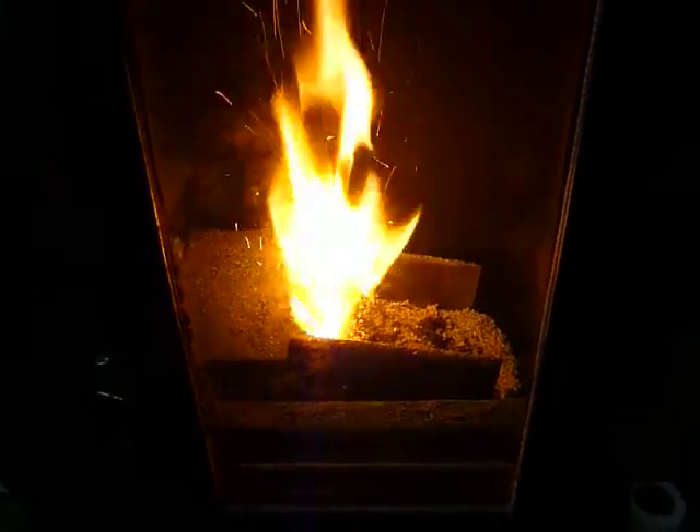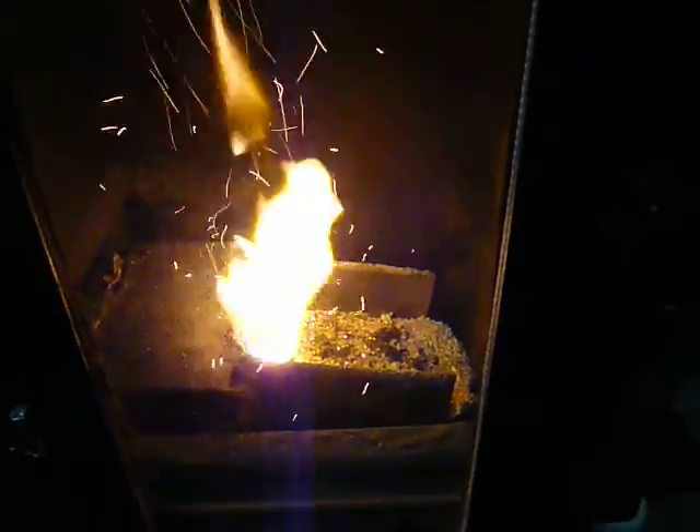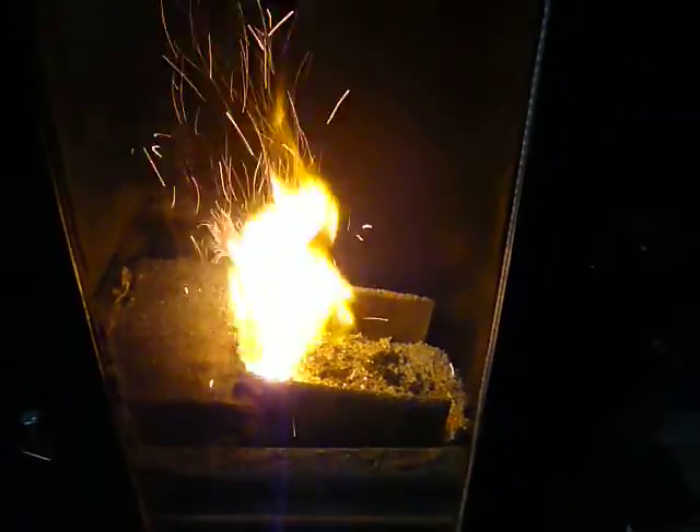It differs from a lot of the ones I've seen on the internet. Instead of just having a flat plate that slides backwards and forwards, there's actually a block mounted on the back of it, so it pushes forward and then pulls back, pushing the coal forward. What I found was happening is that the ash — you can see there it's actually a clinker type stuff — it'll hang about 2 inches over the end of the bed and then break off. It was slowing the pushing down enough that the plate was just sliding backwards and forwards and not actually doing a lot. So I put the pushing block on it.